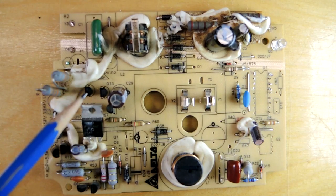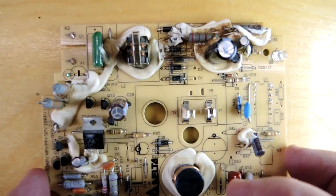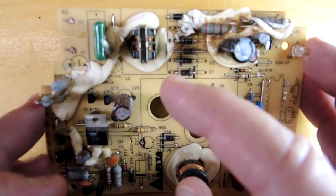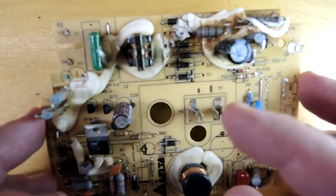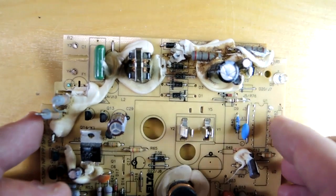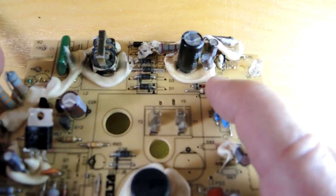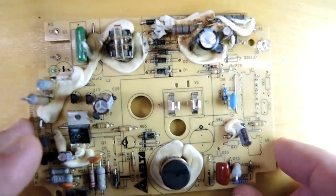The microcontroller was certainly quite interesting. Looking at the topology: the AC input was here, and these little tangs are the DC output that went to the battery pack — supporting a battery between 7 and 14 volts. These two parts are for conducted emissions: an inductor and a capacitor that prevent noise being pushed back into the power supply. There's a large series of diodes — four of these are likely a full-wave bridge rectifier — and two more feed into circuitry for the microprocessor. There are two very large-looking resistors. There's a small semiconductor here which I thought might be a voltage regulator, but it's actually just a 2N3904 NPN transistor, so I presume this forms a low-voltage power supply that powered the controller.